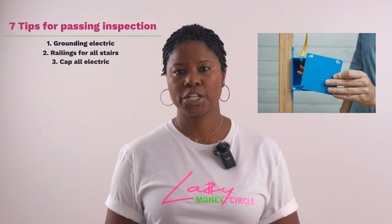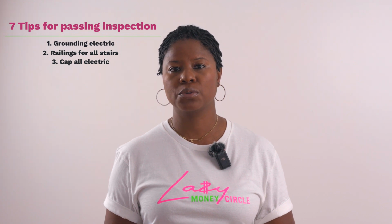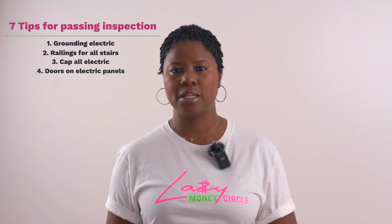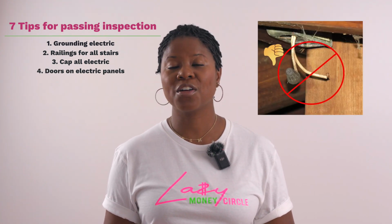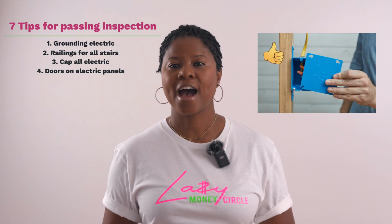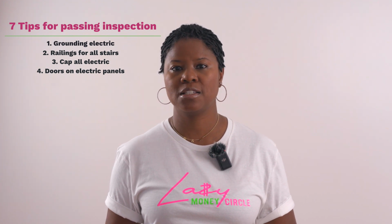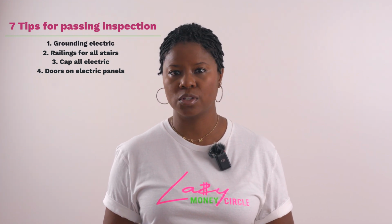So again, ask your electrician, but make sure you do a walkthrough or have your boots on the ground person do a walkthrough, check all of those wires under the beams to make sure all the wires are capped and nothing is exposed. I've failed before from that and I was outraged because it was such an easy fix. However, it's easy to overlook.